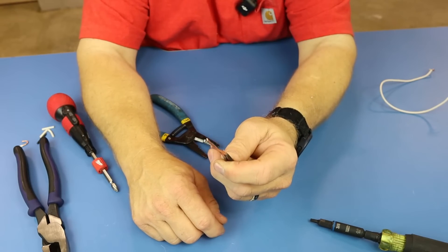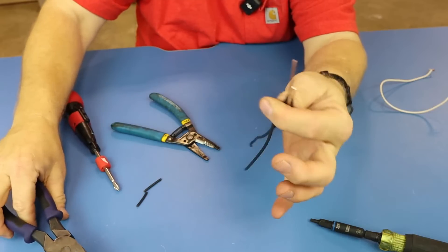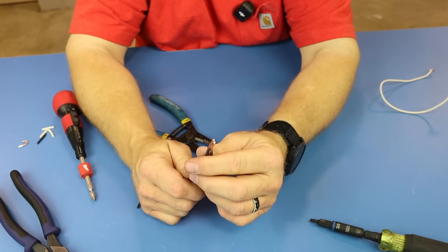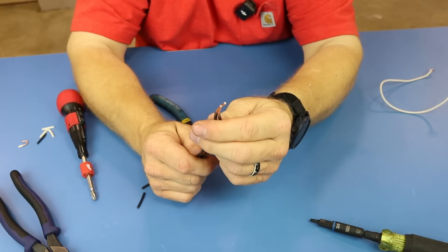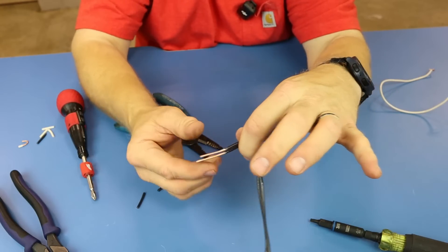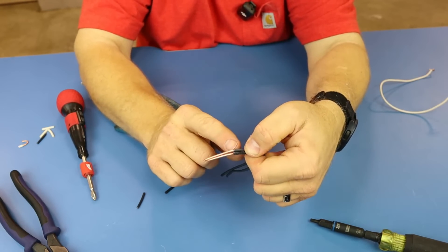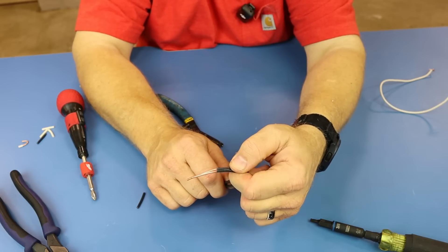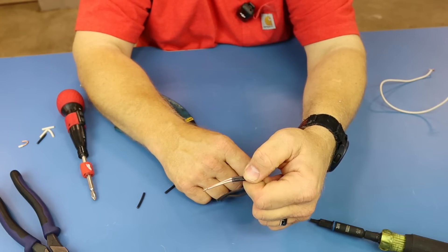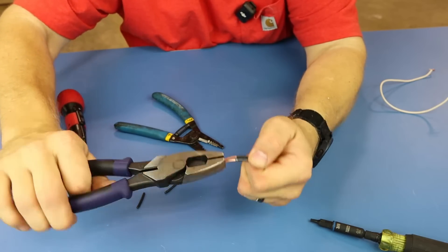Another very easy thing to do — I see my students trying to twist the wires straight like this. You can do the same thing in a box, in a panel, anywhere. All you need to do is line up your insulations, then turn a right angle on it so it looks like a seven. Keep the insulation lined up — mine is still lined up. It doesn't have to be exactly perfect but it's got to be really close. Then all you do is hold it, take your Kleins, and twist it.